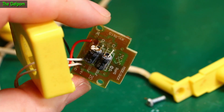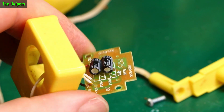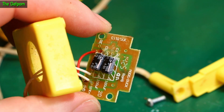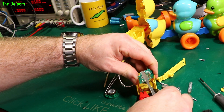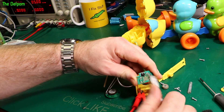100 microfarad caps — they're probably bad too. It could just be normal corrosion, they could still be okay, but I doubt it. It's always a capacitor. Well, I've got power hooked up to it through these clip leads. I've been moving around trying to break through the corrosion, so there may or may not be a contact. Let's see if I can get something through this.